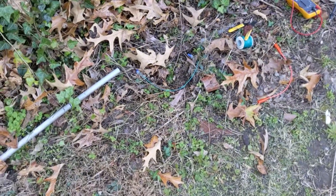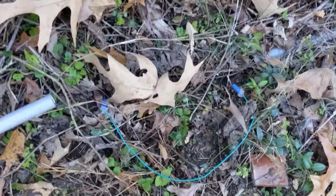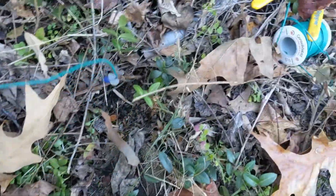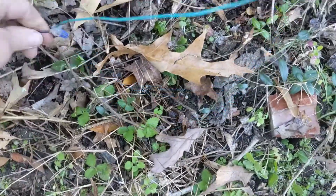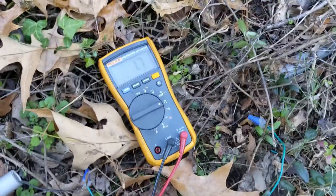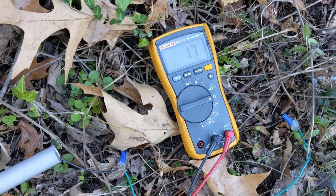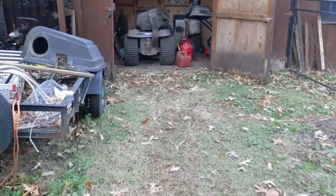Here's the spot I'm looking at. I drove a tractor here earlier in the day and it looks like the wire might be disturbed. I'm going to cut this — it looks like it's already been spliced once here, and this conduit's been broken open. I've connected the ohm meter up to the wire coming from the transmitter and I've got continuity, so the problem is not from here to there. I'm going to go back and put the wire to the test point on the red wire and check the loop in that direction.